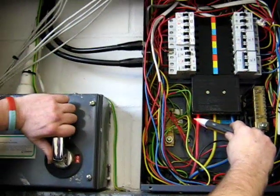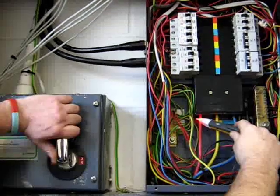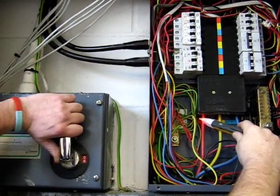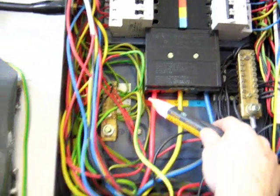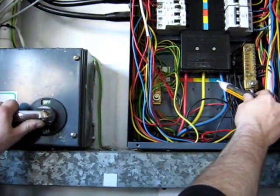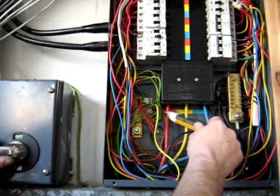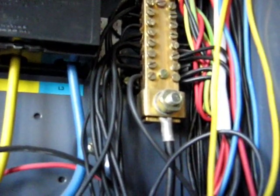The next test is a test of insulation resistance, which requires the installation to be dead. It's imperative that isolation is confirmed. Firstly, the voltage detector is placed on the cables and verified to be working, then we switch off, and the installation is confirmed as dead. Prior to conducting an insulation resistance test, because the neutral is at potential to earth, the incoming neutral must be disconnected from the distribution board — otherwise a false indication will be presented that the neutral is short-circuited down to earth.